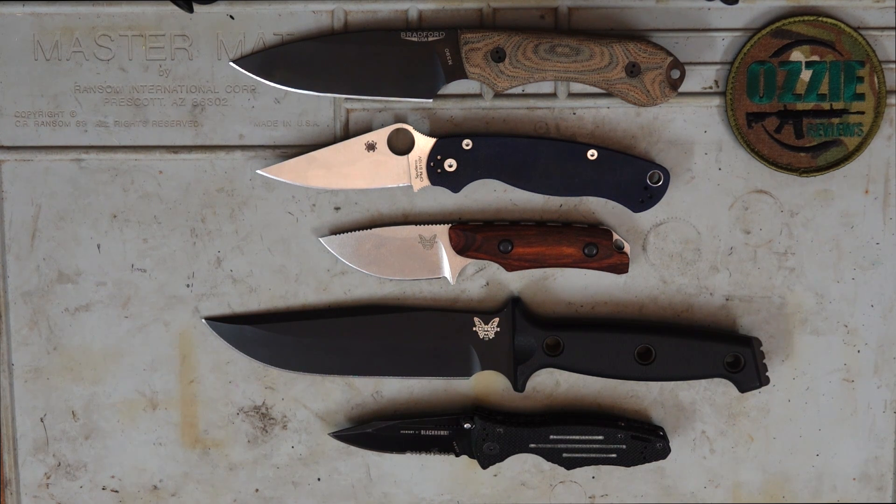As a general rule, as you go up in the quality of the steel the edge retention is a lot better — you're going to get a lot more use from the knife before you need to sharpen it. However, as you go up in quality, ease of sharpening does come down. With really ultra premium steels the ease of sharpening will be very low — in other words it takes a lot to sharpen them.